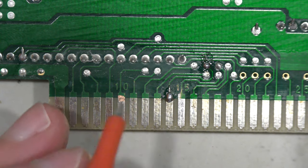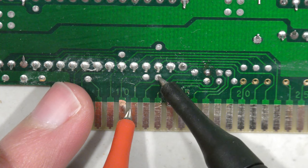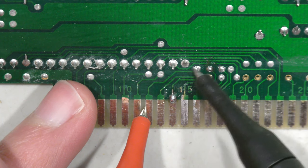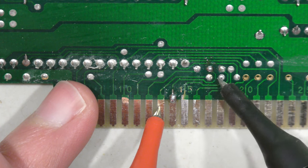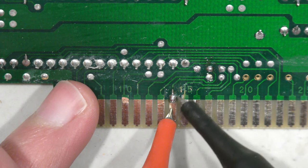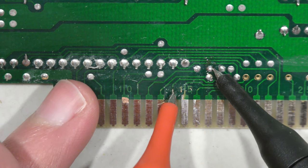I'm going to show you now — some of these traces lead and they do have continuity, but when I get to the one that's been tinned already, that one doesn't have any continuity. So I'm going to patch that. I could just barely make out where I think the break is with the naked eye; you could barely see it.